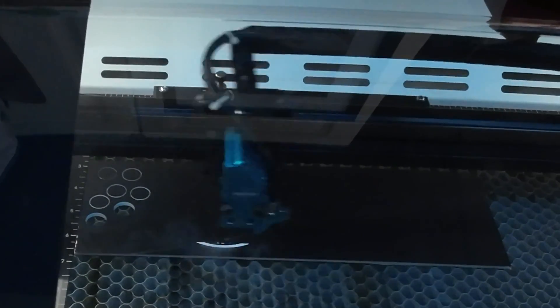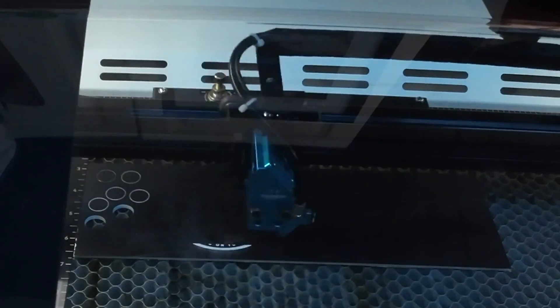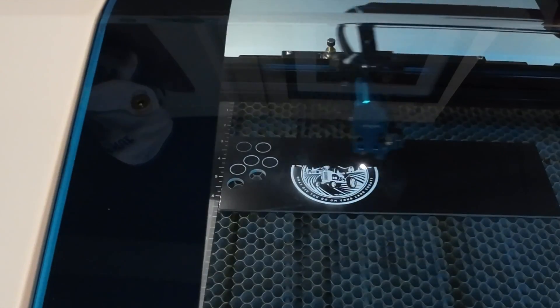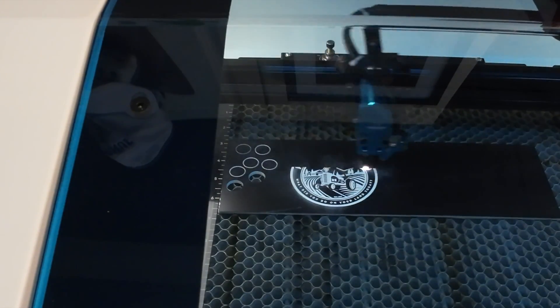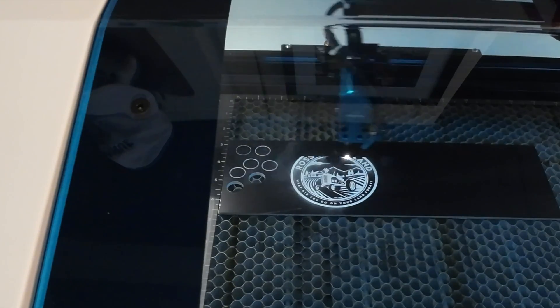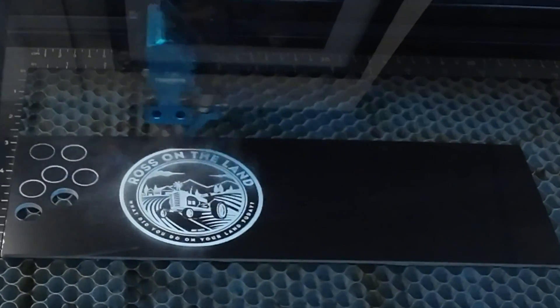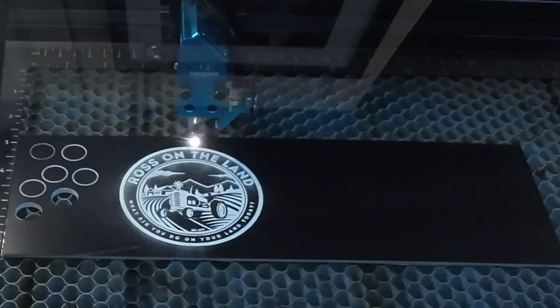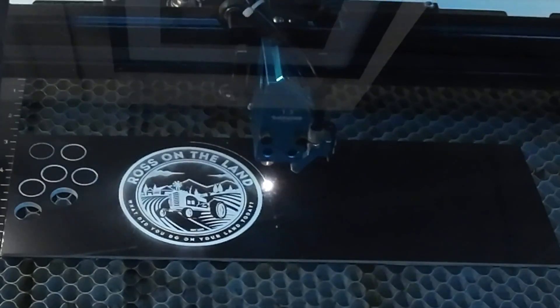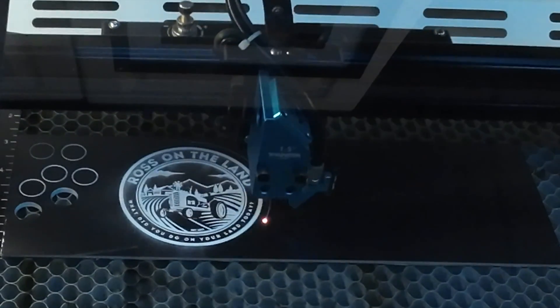Now let's get the logo fired up. I'm going to use the settings I used for the 1/16 for the engrave, but change the cut settings to these new ones. We're going to engrave it first with the 1.5 and then with the 2.5. One question people have asked is whether I use any air on my engrave — I actually don't. I never turn air on for any type of woods, any type of materials, tumblers, or Rowmark when I engrave; only when I cut. I'm all set up, sized the logo, and I've added a ring around it just so I had a cut layer. One and a half inch lens, using my engrave settings and the new cut settings — let's send it.